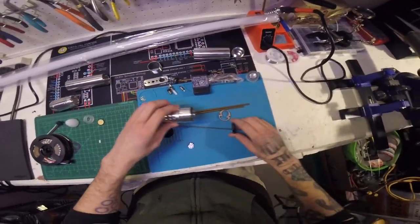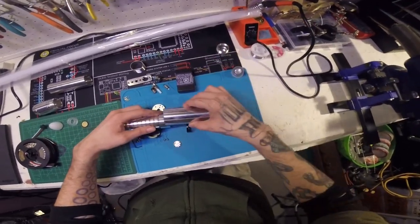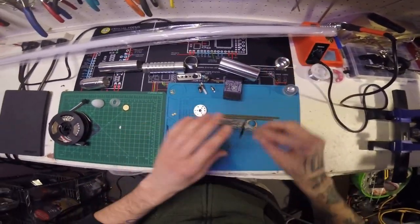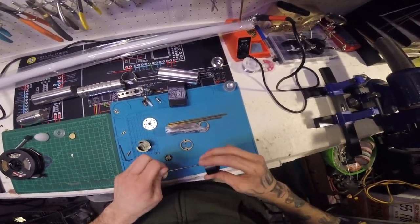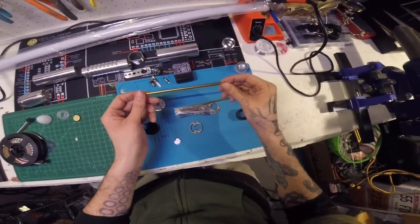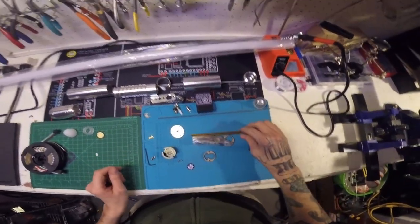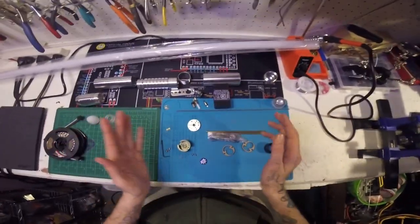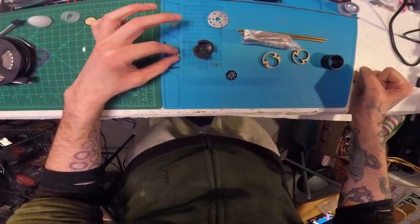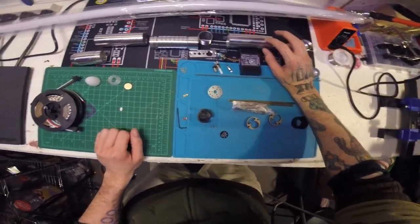Once assembled it'll end up looking somewhat like this, where you'll have all the electronics sticking out and you can slide the outer section on and off and screw it. We also have hollow brass tubes which we cut into pieces and use as spacers between the discs so that everything doesn't slide around on the chassis. We have tiny set screws to hold the blade in place, and we'll use another one in the body so that the chassis doesn't wiggle around at all.